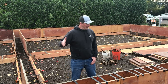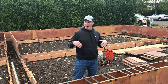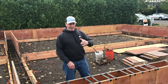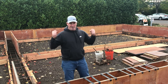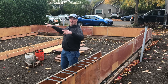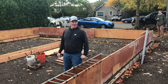We're going to mark where all of the anchor bolts go — those are what actually tie the building to the foundation. This is a simple home that doesn't have any major hold downs, which would be very long curly steel bars with threads, used to anchor down certain portions of the building. We brought the laser; we'll go around and double check the elevation, make sure everything's good, and pull a square from corner to corner to make sure the building is square. If not, now is the time to fix it.